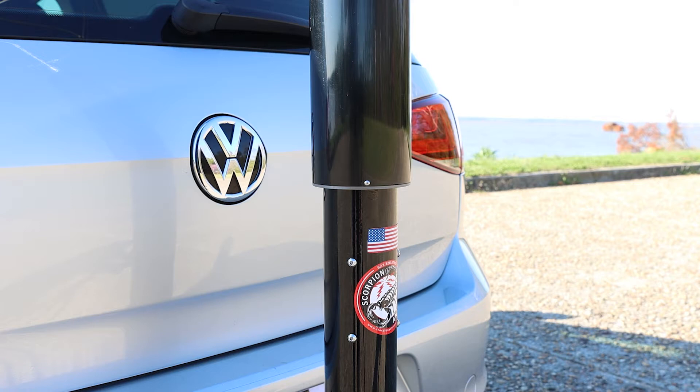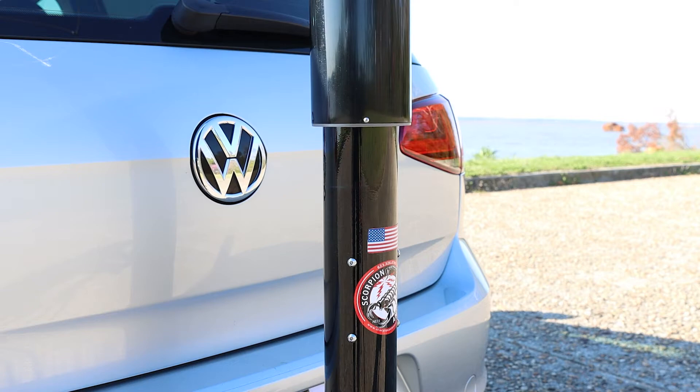The thing that's pretty cool about screwdriver antennas is they have a motor in them that moves the coil up and down to make the antenna resonant on a bunch of different frequencies. This is rather than using a long wire or a big giant antenna that isn't necessarily resonant on many frequencies, where you'd use a tuner to impedance-match them. Instead, a screwdriver antenna can be adjusted for resonance, so you're making the antenna match the radio rather than putting a tuner between the radio and the antenna.